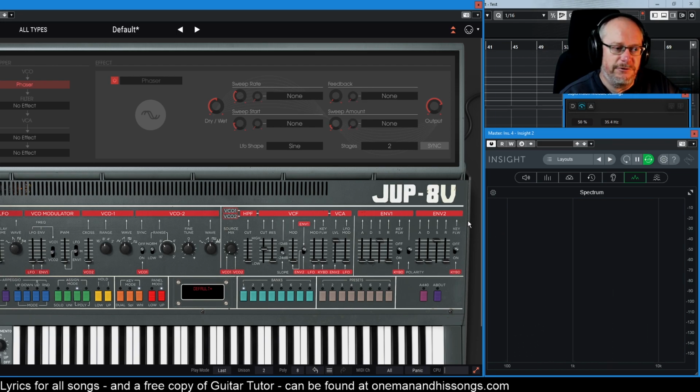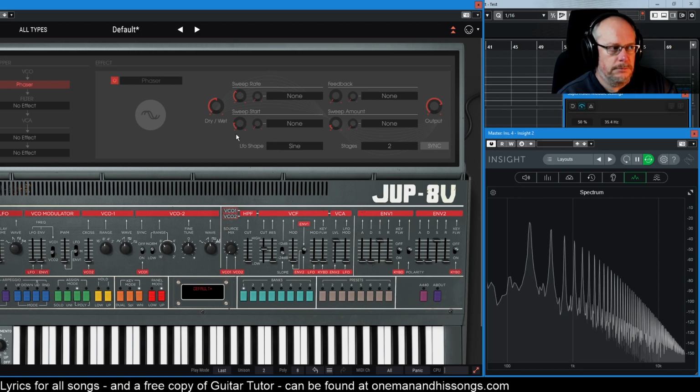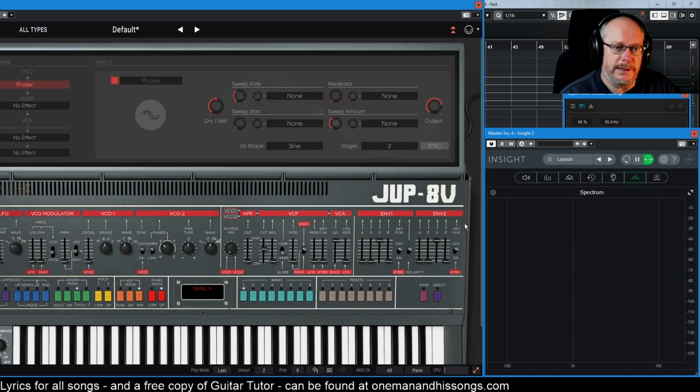So there is still a frequency sweep, but it's just in these low frequencies now, around the 211 hertz center point. Pull this right down, and now we'll be lucky to see any change at all. There, we're just coming in now. There we go. So it started out at 20, it swept through the frequency curve, and it's just about hitting the fundamental and then disappearing again.